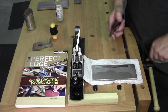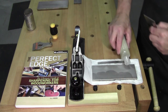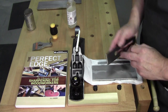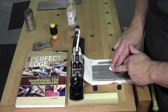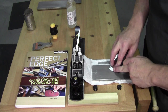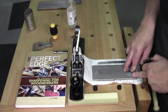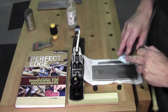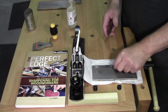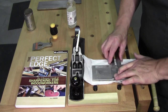So I know there's no burr back there. I come up here, a little more fluid. My primary bevel is still visible there — I find it. Find my primary, I raise it just a hair, and I sweep: one, two, three, four, five, six, seven, eight, nine, ten. Feel for a burr. There. Go back, remove the burr. Done. That's ready to go back in the plane.